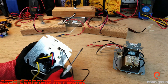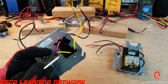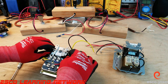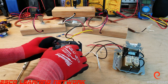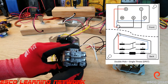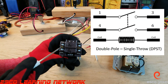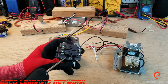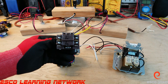They run around to the back here to the relay. The black and the blue down here go to the coil of the relay. Let's unplug this relay so we can see what kind of relay we're dealing with. We'll take this little bracket out which keeps it from popping out when the relay is energized. This is a 24-volt coil pilot duty relay, and this particular relay has four terminals: 1, 3, 4, and 6, and then down here the coil of the relay.